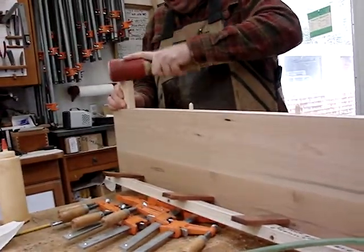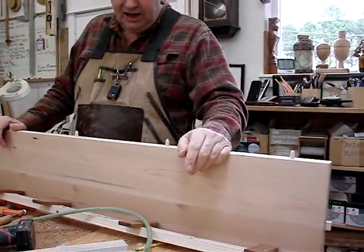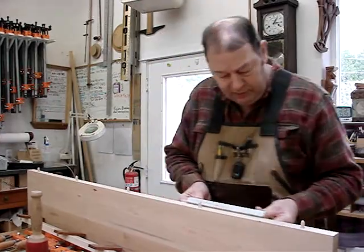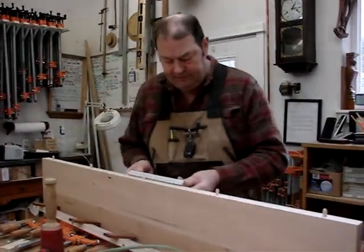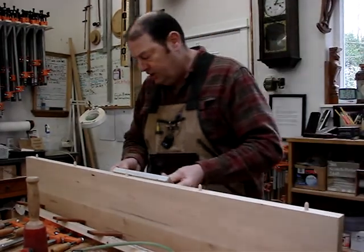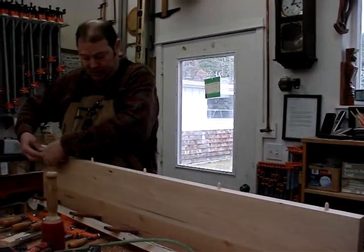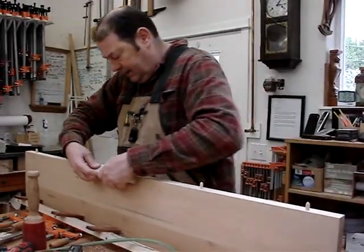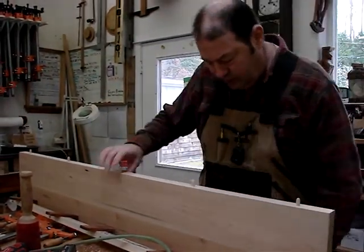So now we've prepared the female side and we've prepared the male side. I did not break this edge — I should have, when I sanded this, I should have broken this edge just a little bit. Because that razor-sharp edge is delicate. So when you've got a delicate edge like that, it's easy to damage it when setting down. Just gently break those edges.